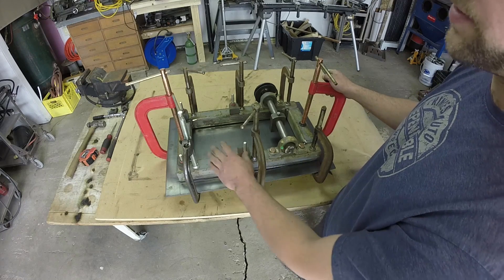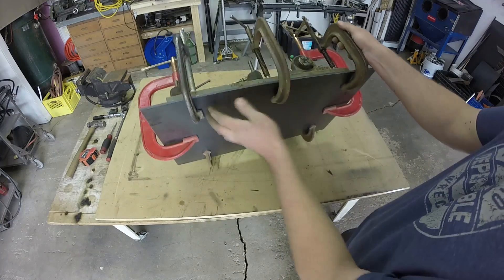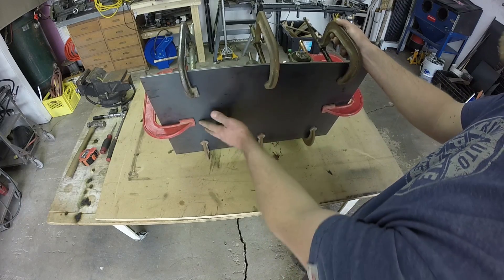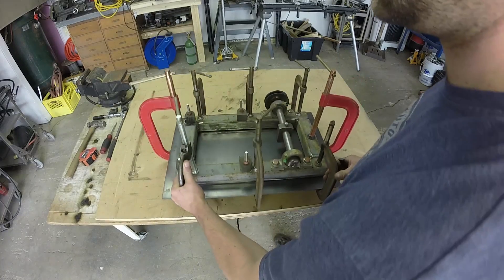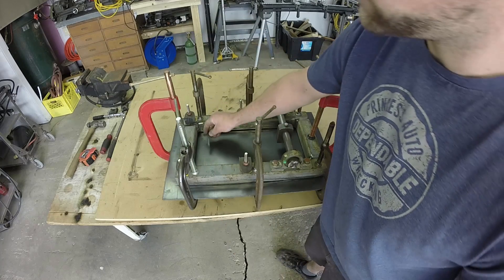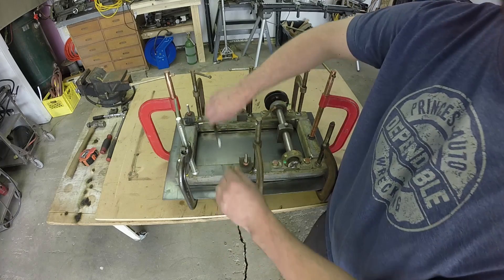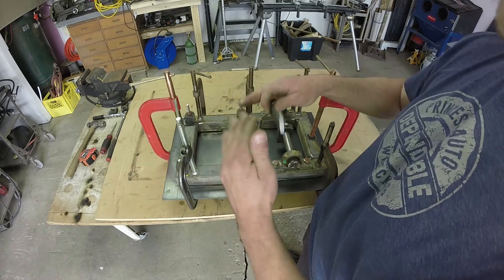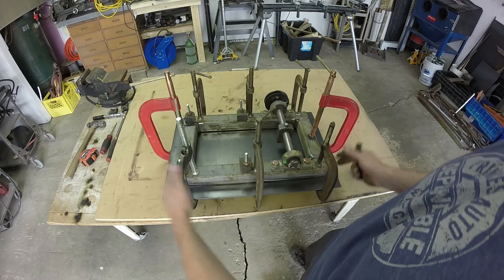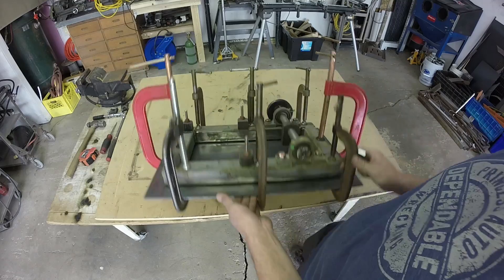With the motor off, I'm down to the bare frame again and I've secured the plate that's going to be the compacting plate to the bottom here. It's 3/16ths plate, which I know is a little thin compared to most compactors, but what I'm going to do is along the inside of this frame I'm going to run quarter by three-quarter flat bar that I had left over as ribs, spaced every two inches or even closer. I'll weld that all the way along to give a lot of strength to the middle of this, and then I'll probably try to roll the edges of the plate up.